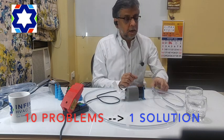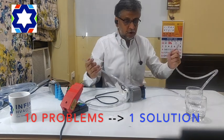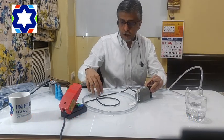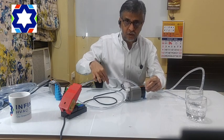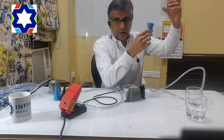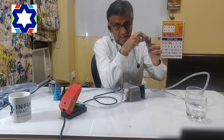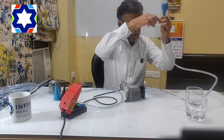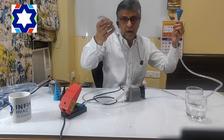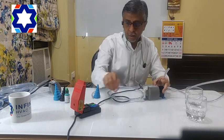I'm going to show you how it's done with a demo. This is your suction pipe and this side is your discharge pipe. You just connect a quarter-inch pipe on the suction and a quarter-inch pipe on the discharge. You get reducers along with the pump, so you connect your high wall or fan coil unit drain pipe into this and cut the balance to whatever length you require. The different sizes are 3/4 inch, 5/8 inch, half inch, 3/8 inch, etc. You seal it up, connect the quarter-inch pipe into the suction of the pump, and the discharge you take and throw it away into the drain pipe. I have just connected this drain pump with live, neutral, and earthing wire.